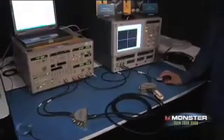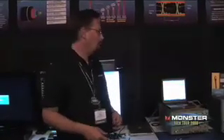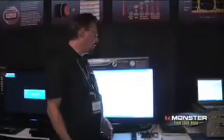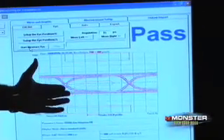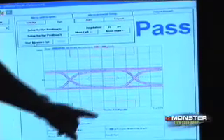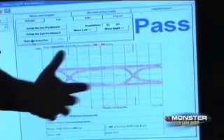Now we're going to hook up a Monster HDMI cable at 4 meters — previously the other product was only 3 meters — and that's one of the other challenges with bandwidth as well: the length of cables. So it's kind of an unfair advantage because we've added one more meter to try to do the same thing the other one did. Let's see how Monster actually does. Einstein now has this at high speed — we know we can do standard speed — so let's see how we do. The Monster cable does pass the test. Very nice, clean bit waveform and a very nice eye. Notice that the bit waveform is very thin, which means there's very little jitter getting into this cable.